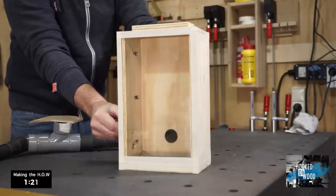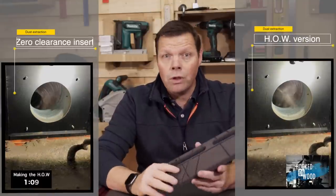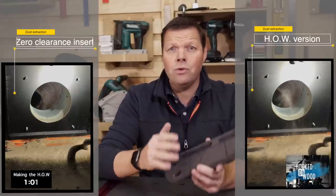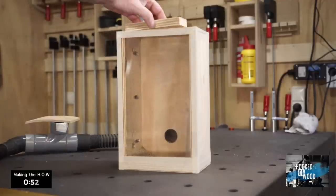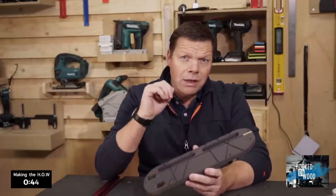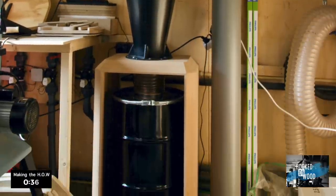To clean up the inside of your cabinet you need enough airflow so it can extract the dust. Normally your cabinet has some holes to cool your motor and to create this airflow, so you should not close these gaps — leave them open. When you combine them with your Hooked on Wood Zero Clearance Insert, you increase the airflow even more and get more effective turbulence and dust extraction. But making more holes has consequences: if the air inlets are too big, you create more air volume with lower air speed, so it has to be in balance with your system. For me, I ended up enclosing the caps on the underside of my table saw. Your whole system — dust extractor, piping, piping distance, and piping size — all have influence, so just try and see what is the best balance for your system.